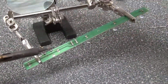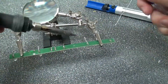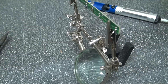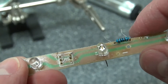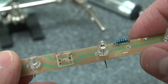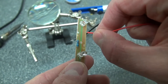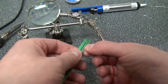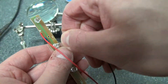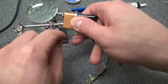Now it's time to remove all of the original LEDs and replace them with the new infrared LEDs. I've placed a 1k ohm resistor — originally there was a 10 ohm resistor. The reason I put such a higher value of resistance is because infrared LEDs are far more sensitive than regular LEDs. If I left the 10 ohm resistor, the infrared LEDs would have just burnt out. Alternatively I could have used a lower voltage, but I'd rather use a 9 volt battery because 9 volt batteries are easier to use and more compact. So I'm going to solder the 9 volt battery connector onto this circuit.